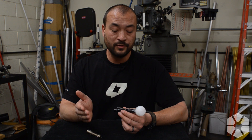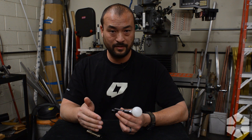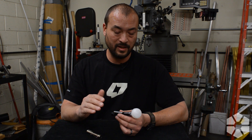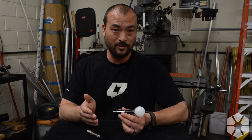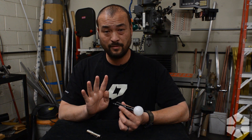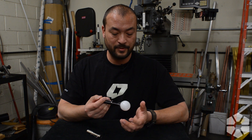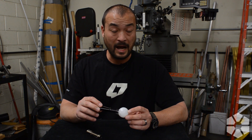So the normal configurations being three and four — medium and high, and then low/moonlight, medium and high for configuration four — burst is a way to have an extra mode without having it in the settings you scroll through normally. This is set on configuration four, which is moonlight, medium, high, and then burst — effectively a three-mode light with a bonus mode. Configuration three with medium and high is basically two modes with a bonus mode being full output.